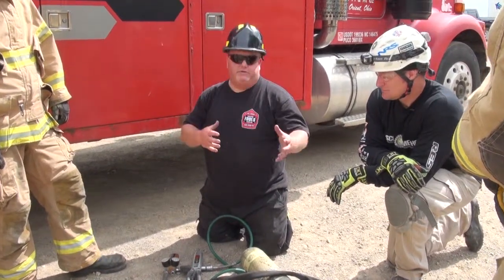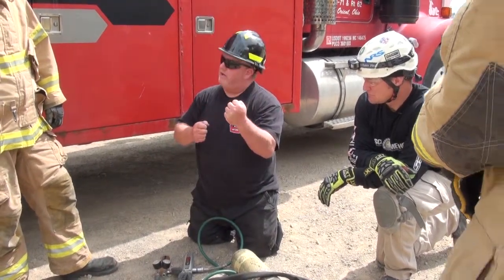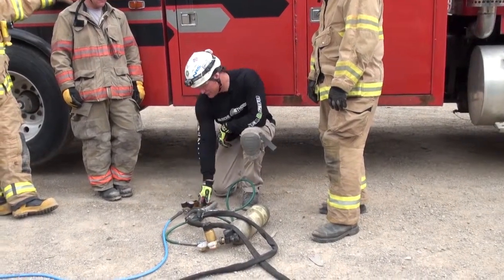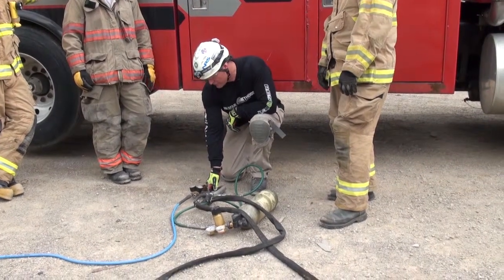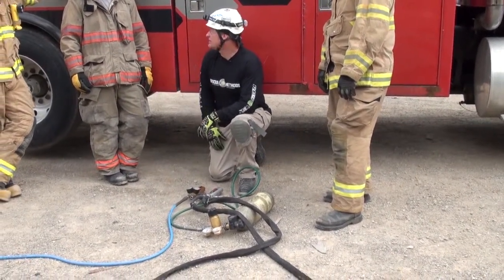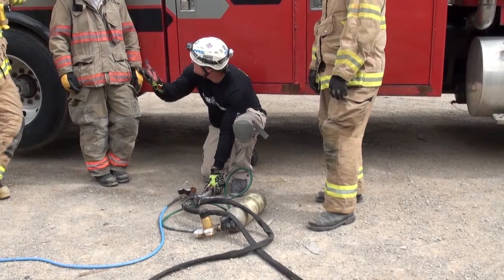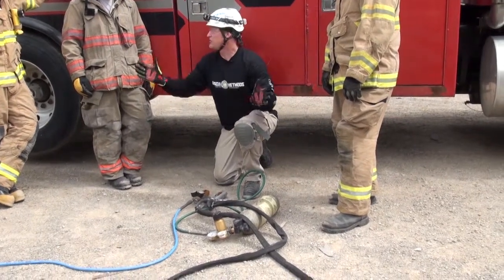You can't drop it with the load on it. So if you take a strut and hold your pressure against it and hit that green button, it won't come down. If I don't have 2 bar of air on there, I'll usually goose it a little bit to get back up to that 2 bar. I'm watching the load — want to make sure I'm not moving. Once I'm at 2 bar, I know I've got enough in there to disengage the lock mechanism and come back down. I'm going to hit and hold on red on the struts, go up on my airbag, and immediately rock down to the bleed on the airbag, taking the pressure off the strut so everything walks down together. The greatest thing is if the load starts to get unstable or something bad happens, I let go of everything — it blows off the excess, and the struts lock and hold the load right where it's at.